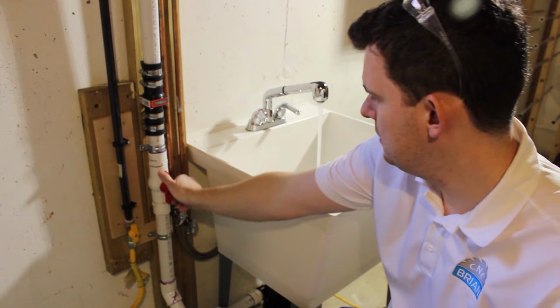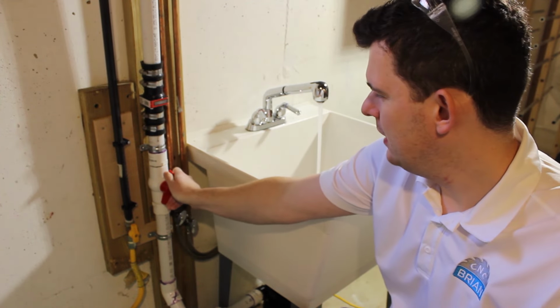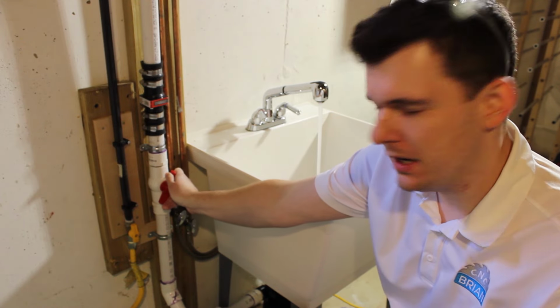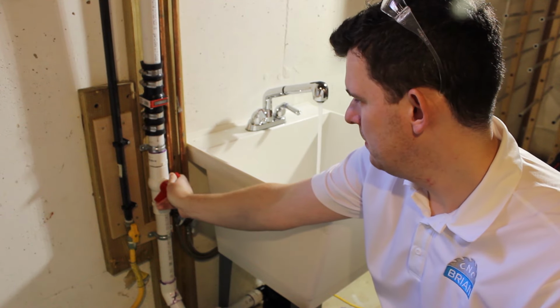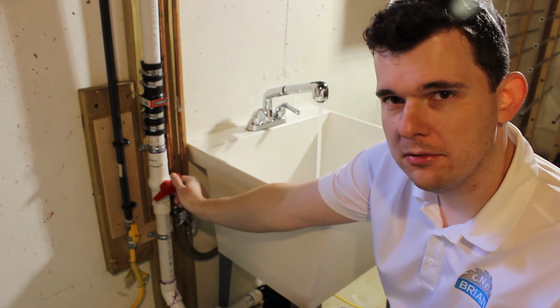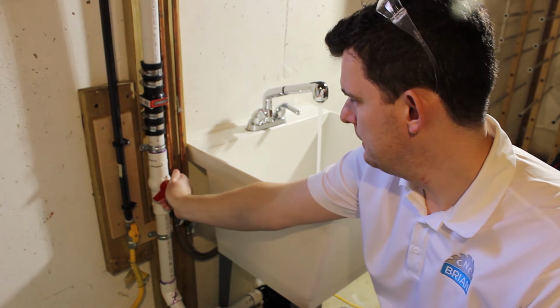We don't want that. So what we're going to do is adjust the ball valve. And what you imagine is, I think the flow rate is double what the pump can put out, what this sink is probably putting out. So we're probably going to have to close this valve almost 50% or more. And you'll see as you adjust this valve, it'll stop cycling. That frequency will change.